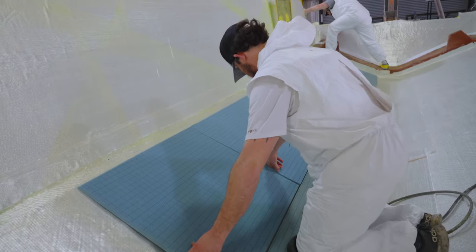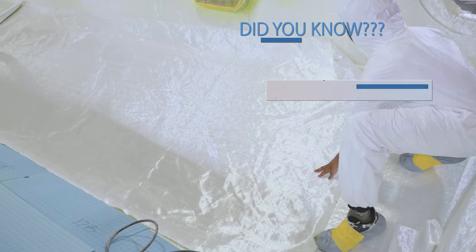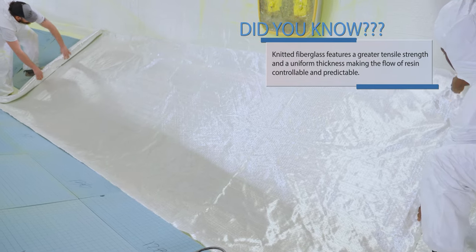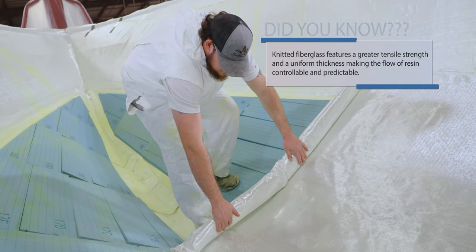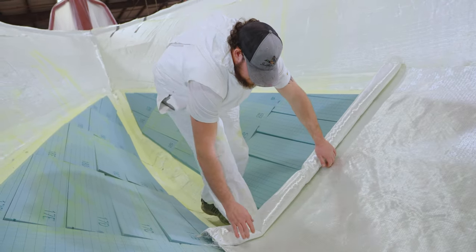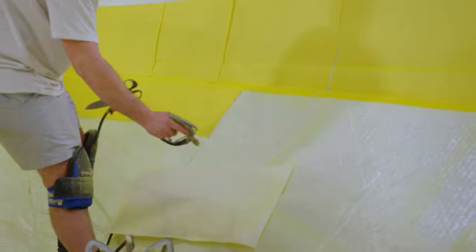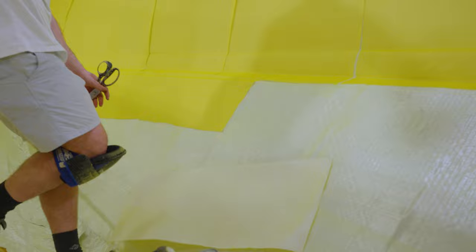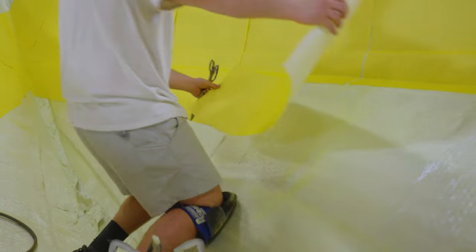Same as before, the coring is encapsulated with more fiberglass. At this point, the dry loading is complete and the setup for infusion can begin. Each part is fitted with a specified number of paths to allow the resin to flow once the part is under vacuum. This is achieved with a combination of spiral wrap tubes and resin flow distribution media.